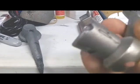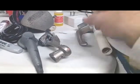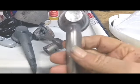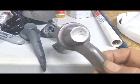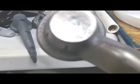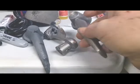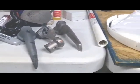Some of the knobs still got nickel on it, so it'll be a good test piece to see what happens in flash copper. This handle here is actually a usable handle. It's got some pitting, and the top of it here, that center, had some real deep pits in it, and I MIG welded those, so I'm anxious to see how they plate. But they've been laying here for a while, and they'll have to be sandblasted again.